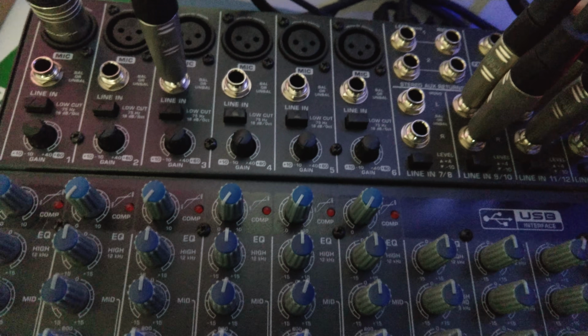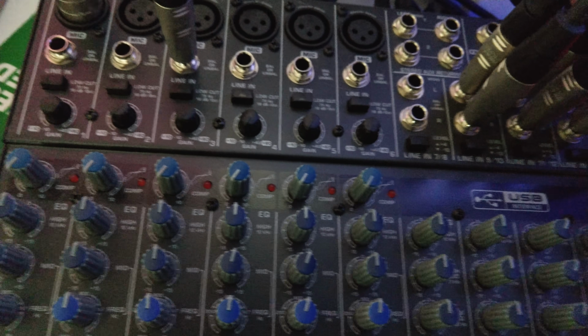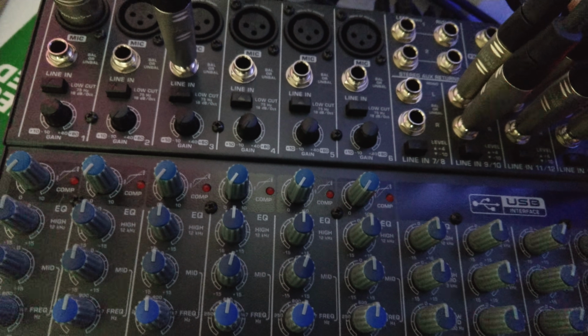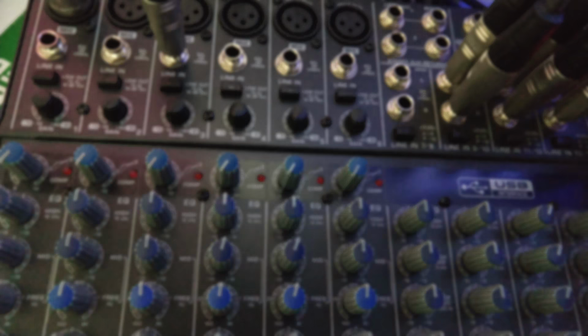With my mixer as well, the 6th mic input shorted out at some point. Whenever I was using direct mic inputs and needed phantom power, I turned on the switch, the compressor light for that input would always light up when turning it on and it would pop. Even without phantom power, that input just does not work and never really has.